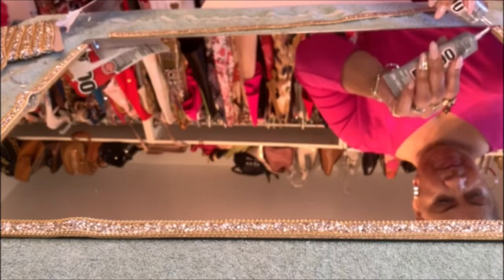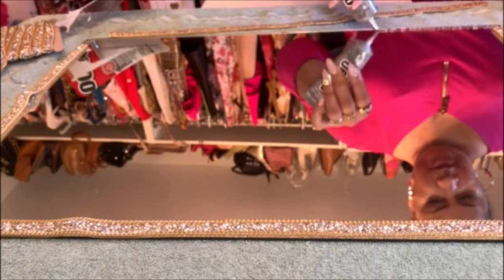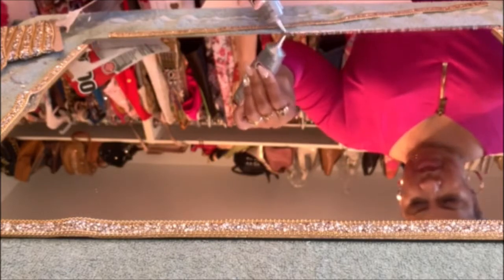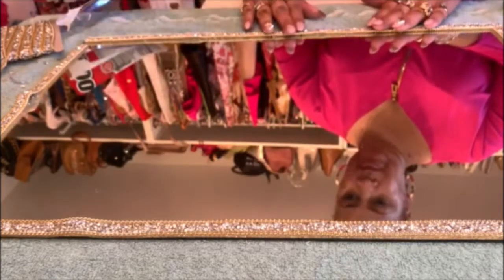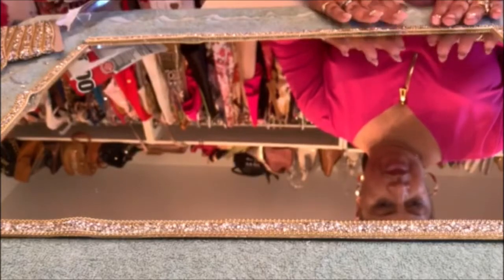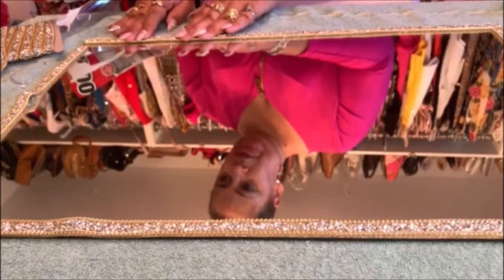Run a line from top to bottom — don't have to put too much because this trim is not very heavy, so I'm thinking it's not going to try to come off. Going to put this right here with just a little pressure, and I want it right at the very very edge. Make sure you have a straight line because when you hang your mirror up you don't want it to look off.